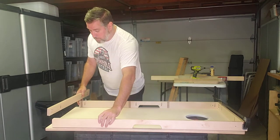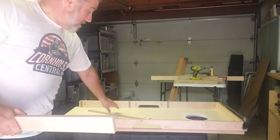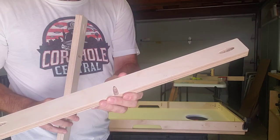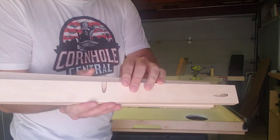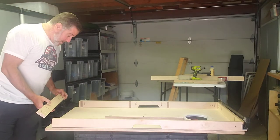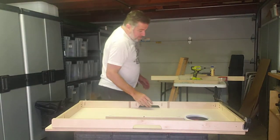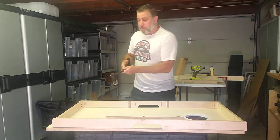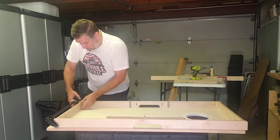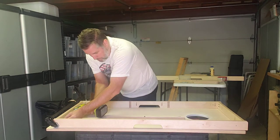So that's one end. Now the end pieces are just slightly less than the height of the frame rail so that you get a nice little reveal. There's also a couple of pieces that are thinner — those cross pieces go under the board to give it rigidity and prevent bounce and noise. There's only one screw there on each side just because it's a smaller piece of wood. The grooves mean you don't have to measure anything, just pop it into place. We'll clamp that the same way, push everything down against the surface of the deck.